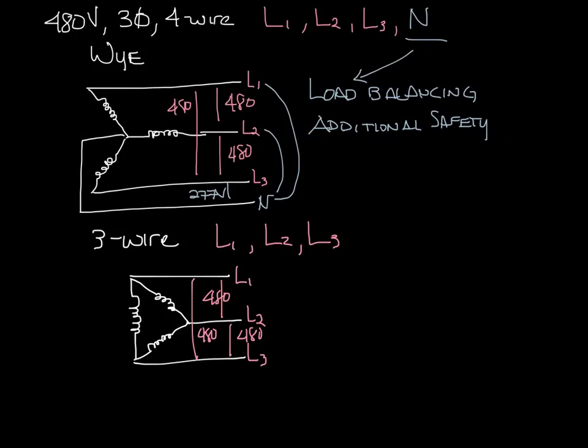So what does this have to do with terminal units? Well, this mostly comes up with 480 volt electric heat and fan boxes with 277 volt motors. Sometimes people expect a 480 to 277 volt transformer when they get their 277 volt fan box. But a 480 to 277 volt transformer is not a standard transformer ratio, so it'd have to be custom wound, and that would make them expensive.